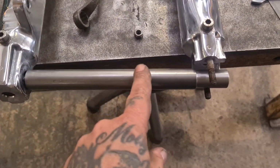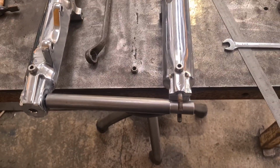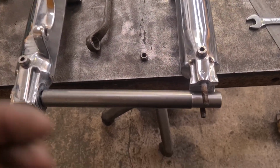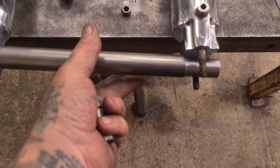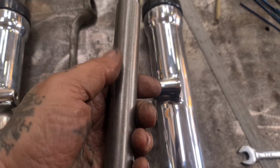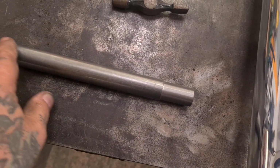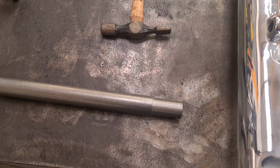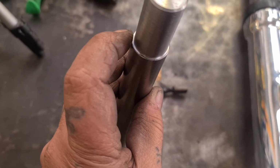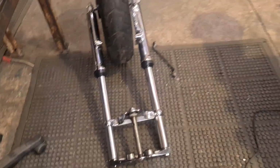All I've got to do now is make the wheel spacers. I might do some quick, cheap and nasty spacers just to rough it out and just to have a trial fit, because I'm a little concerned that there's not going to be enough wiggle room, if you like, which gives me another dilemma then, because the reason I've gone for the bearing being full size and not following this 22mm 7/8 all the way through and making wheel spacers with adapters was that there's not a lot of difference between the two, and the adapters are going to be really thin, and I didn't really want that, so I'm hoping this method works.